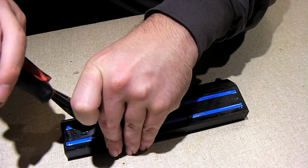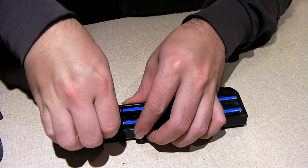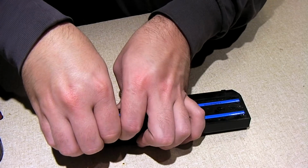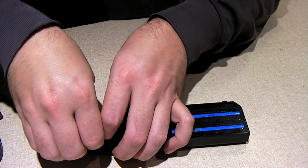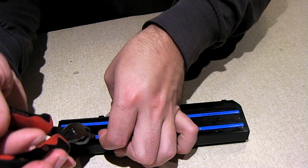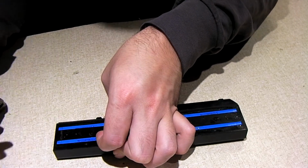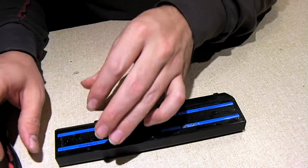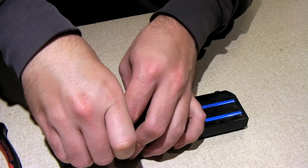So what I'm gonna do is I'm gonna try to pop this plastic. And as you're tearing into a pack like this, keep a watch on the temperature of the cells. If any cell starts getting warm, you're most likely shorting something out. So just be prepared to act if something shorts out. Try to remove the short, of course, but if you can't, head outside immediately, because you don't want one of these packs to catch fire in your house.